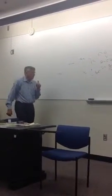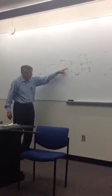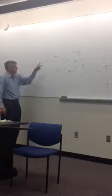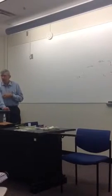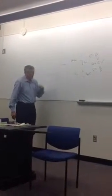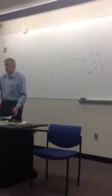But if we do Kirchhoff's voltage law, we had a 10-volt rise minus IR minus zero equals zero. Therefore, the voltage across that 1K resistor is going to be the full battery, or 10 volts. Well, if we get 10 volts across 1K, Taylor, what's my current?